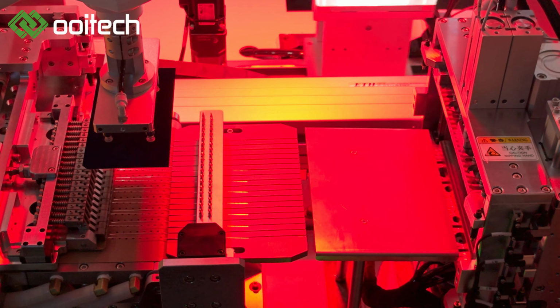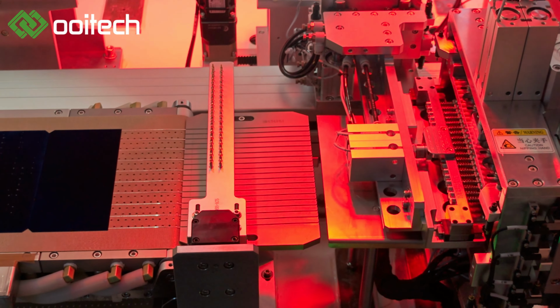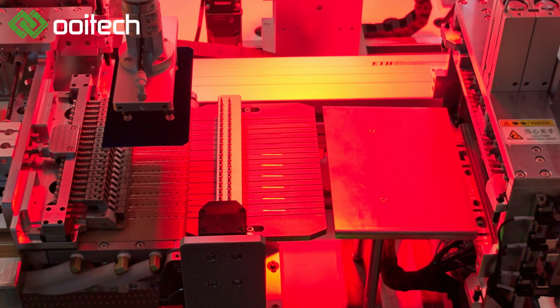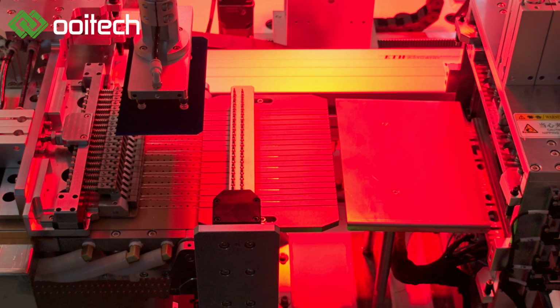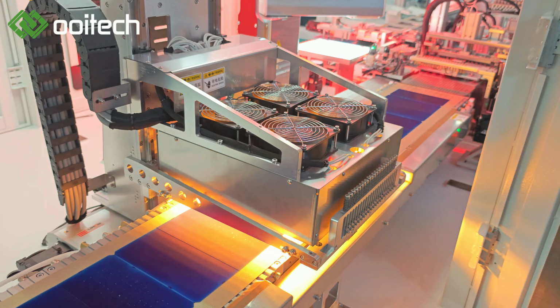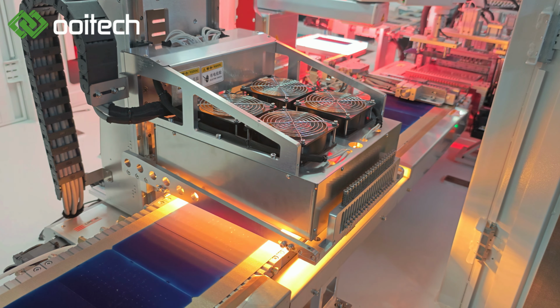Wow. Okay, but you can't do this intricate stuff by hand on a production line. The automation must be intense. Oh, completely. Automation is critical. You've got automatic feeding with robotic arms, placing the cells with insane precision. We're talking sub-millimeter. Then things like isolation paper removal. Sounds minor, but they use vision-guided systems to peel off protective layers without leaving any residue or causing contamination. Very careful work. Every little bit counts.